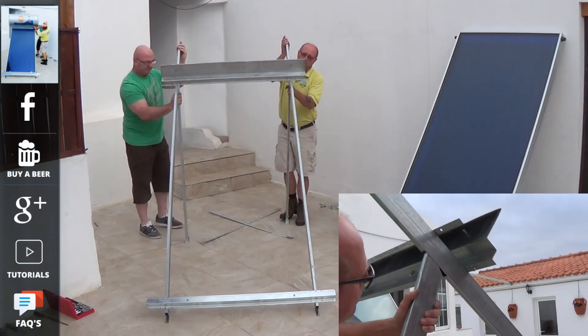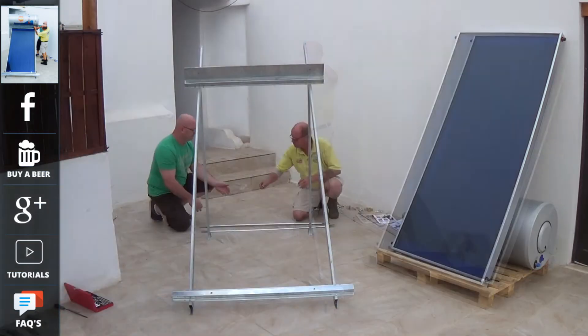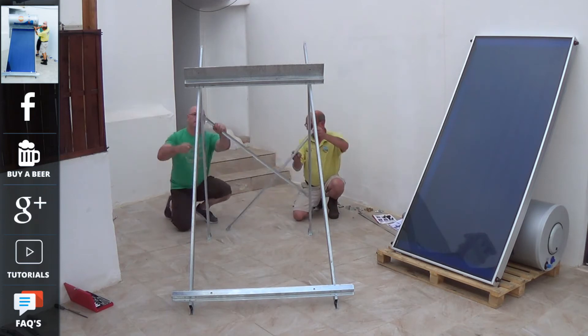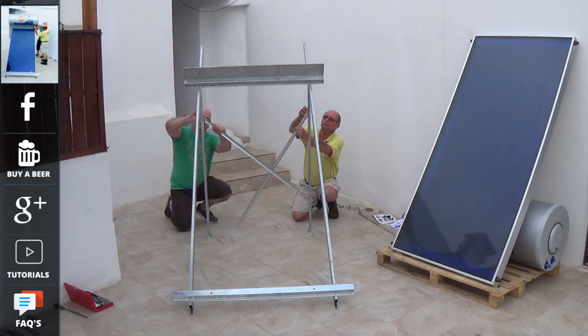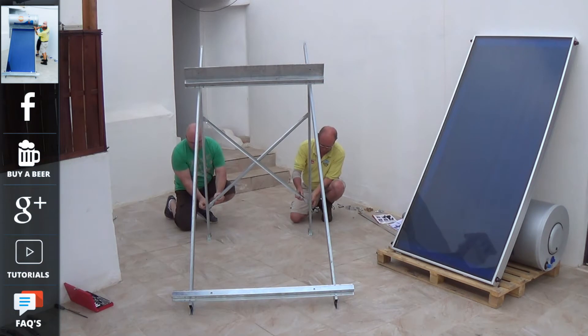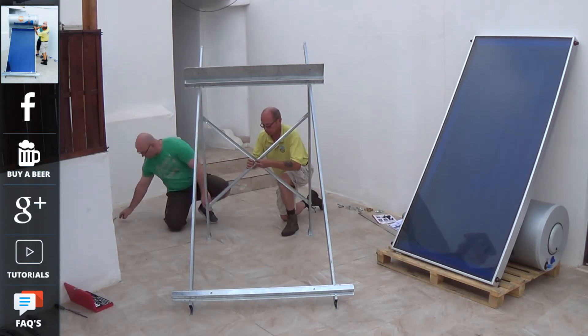As you can see, the stand kit assembles very quickly and easily, and has been tested to withstand extreme weather conditions. All the nuts and bolts are provided, apart from the fixings to your roof structure. As a cautionary note, I would always use some type of locking fluid on all the nuts and bolts, once you have the frame in location, just to make sure they don't vibrate loose in extreme weather conditions, and should always be inspected at least once a year.